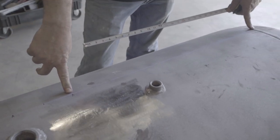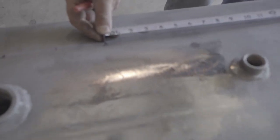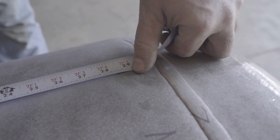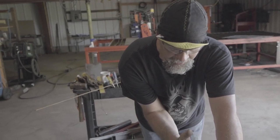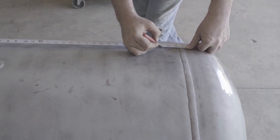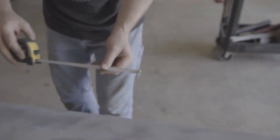The next thing I like to do is I don't want to have this seam incorporated into my door, because talk about a mess - just try fixing that. We just kind of laid the tape measure on there to see what we got to work with. That leaves us about 30 inches to work with, but I want to leave some clearance, so I'm typically going to go about 29. The thing to keep in mind is my cooking racks - if I've got slide-out cooking racks, you may not want to do it this close because you're going to have to fit that slide rail in there amongst that seam. So you might give yourself a little more room. We're going to do 29 over here on the other side from that mark.